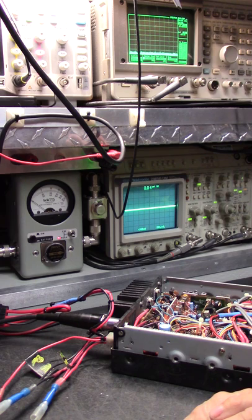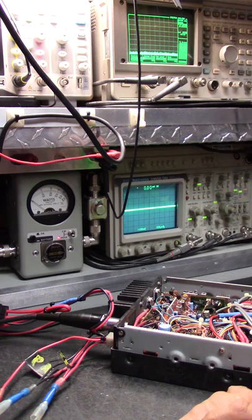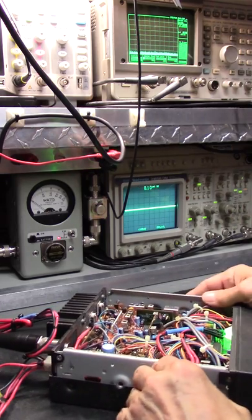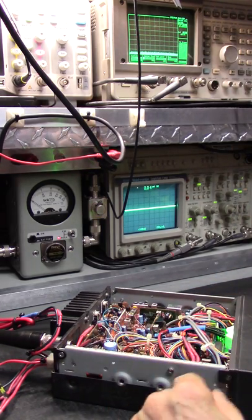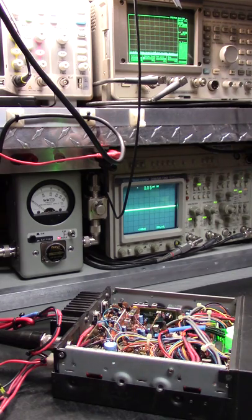Alright. Your 655 is done, the coax is done, for the magnet mount. And I just got this one working. It was working, but flat topping, only a few watts biasing. It was whacked out of proportion. Now it's all set back up beyond factory. You know, you could do more than just factory tune. We're not always talking power, we're talking clean.